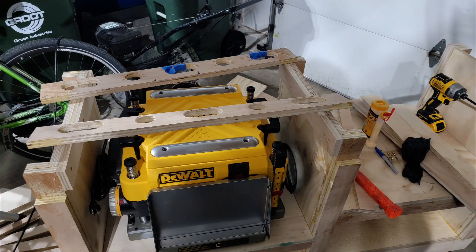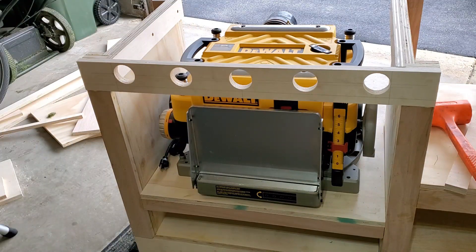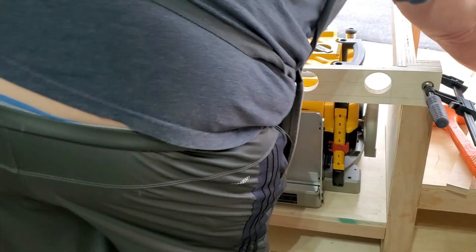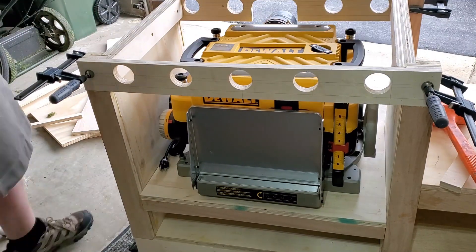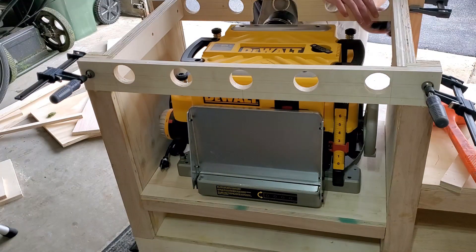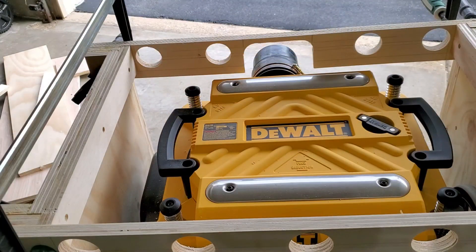Because of that I need to make a change, and to do that I need to remove these side pieces and redesign them. I went with a five-hole design, which will allow me to have more spaces for clamps without the elongated design that could be a little weaker. The biggest change comes on the backside — you can see I've cut a relief out for the dust port to settle into when you raise it. This design also means I'm gonna eliminate the bottom panel of the torsion box, because otherwise it would reduce the clearance I'd have on the planer.